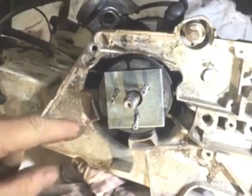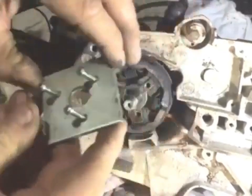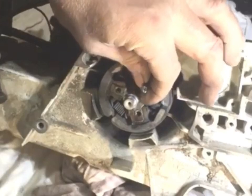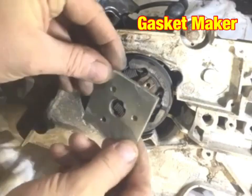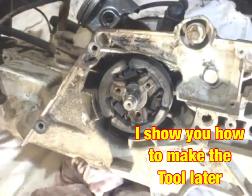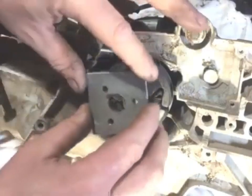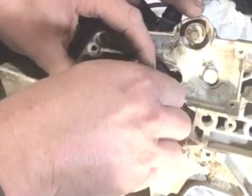All I've got is a square washer. Let me take that back off again because I can explain better. Initially all I did was get some screws with the same thread, put them in, put a little bit of the black gasket stuff on, and then just pushed this washer over the top to mark where I had to drill it. That worked quite well. Then I drilled it, and all I do is make sure they start okay because I don't want to cross-thread them.